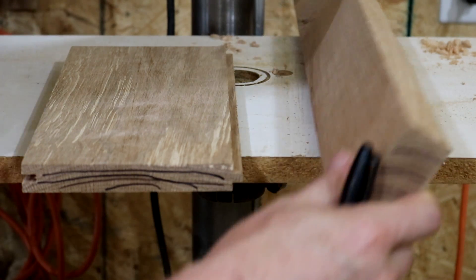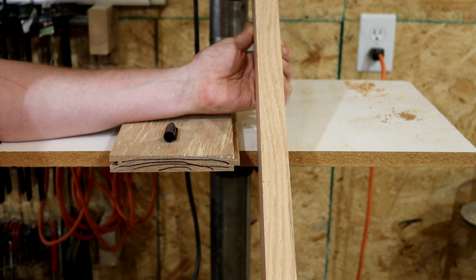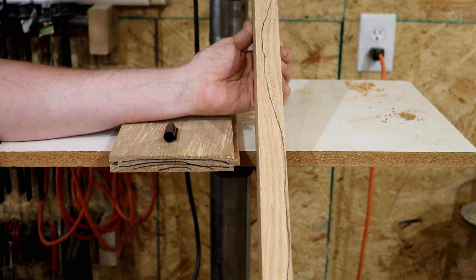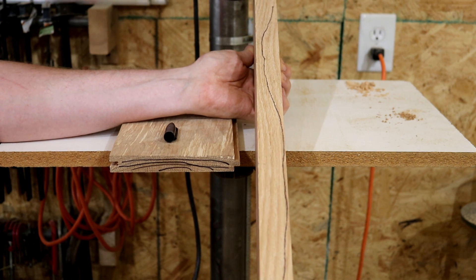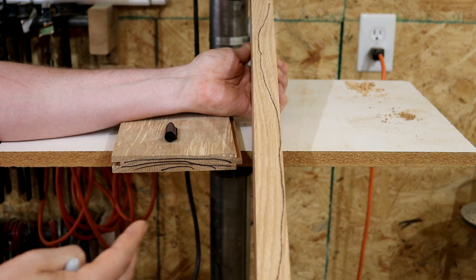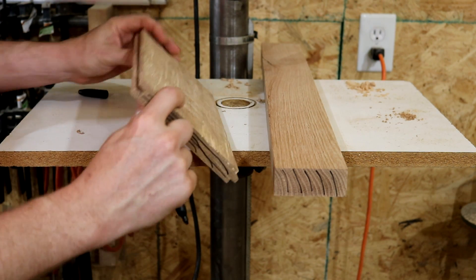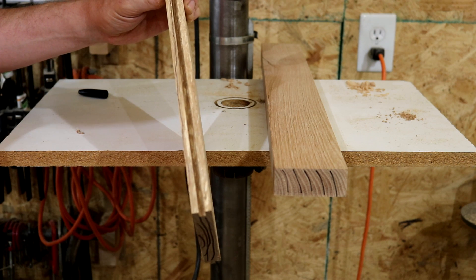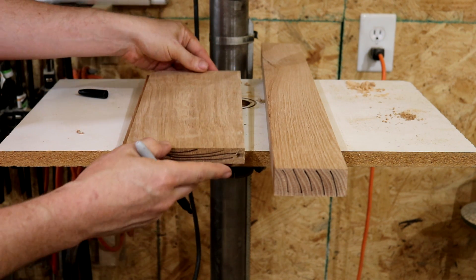The third side we want to look at is this edge itself, and this is where it gets interesting. I'm drawing on this again — you'll see the grain goes like this, comes back in, goes back out. There is actually quite a lot of variance on this side. With kiln-dried white oak it's not necessarily the end of the world, but these are things to take into consideration. The other piece here has some tongue and groove on it, but the grain is going almost perfectly straight down the edge of that board — which gave me a lot of assurance that what I was building was going to end up nice and straight.